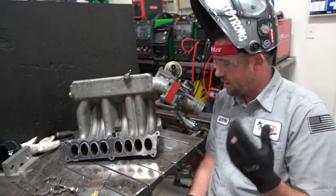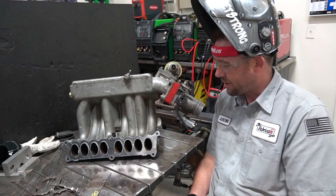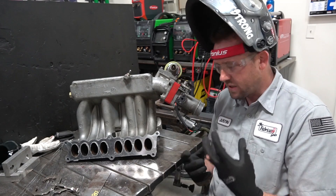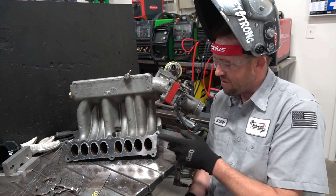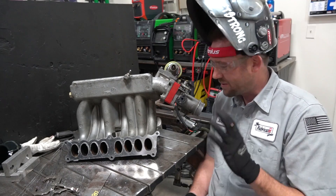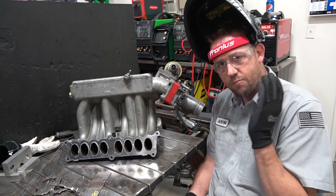Hopefully that gives you a bit of an insight into repairing cast aluminum. At the end of the day, it's actually not that difficult to do — you just got to be really patient, not get yourself in a rush, let all that junk work its way out of there, then hammer down on it and stuff some filler rod in there. Remember, we're not trying to weld the entire thing. We just kind of needed to glue it back together on repairs like this. Some repairs get super deep and you've got to actually build them all up and machine both sides — that's a totally different style of repair than this one. So this one will do nice, flat, and even — goes back on, holds everything down, seals it all up. We're good to go.